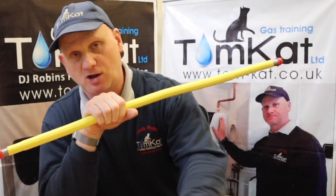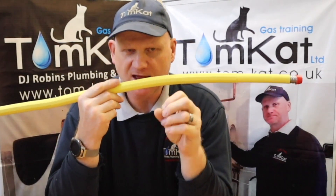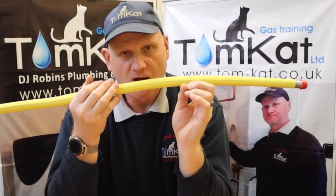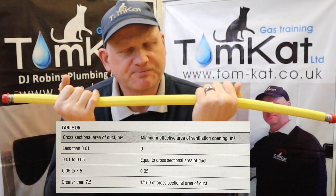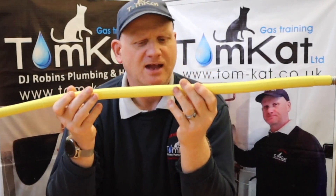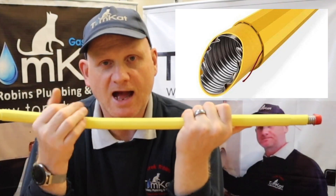As we've seen throughout this video, TrackPipe is installed just like copper - except when it comes to burying in screed. Regulations say a gas pipe must be protected from corrosion and movement if installed in screed, and if it goes through a void or boxing in, it may require ventilation depending on the size. TrackPipe have brought out a newer product called TrackPipe CC, which is the same pipe with an additional jacket on the outside to protect from corrosion and movement, allowing it to go into an unventilated void.